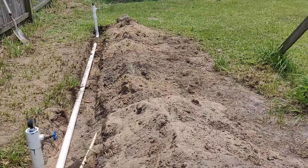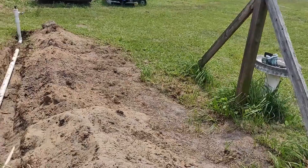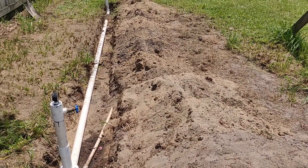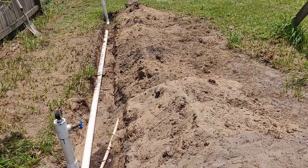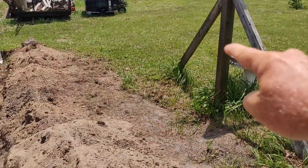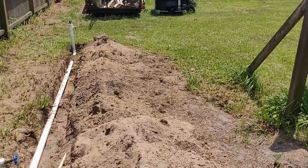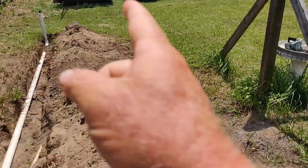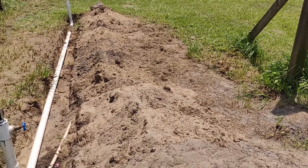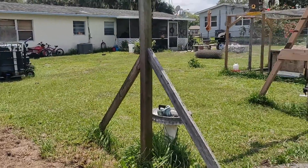Going four-inch, neck down to three-inch, neck down to two-inch. In order to make sure my last irrigation head — this is all going to be garden over here — doesn't have the worst pressure, that's why I have two risers. I'm going to create a loop, tie that in, come down, create a U, and come off with drip line in between everything so we should have equal amounts of pressure all the way down.